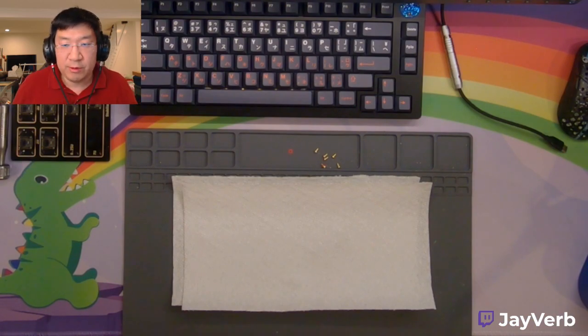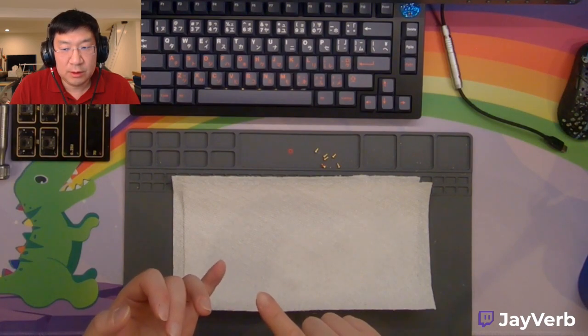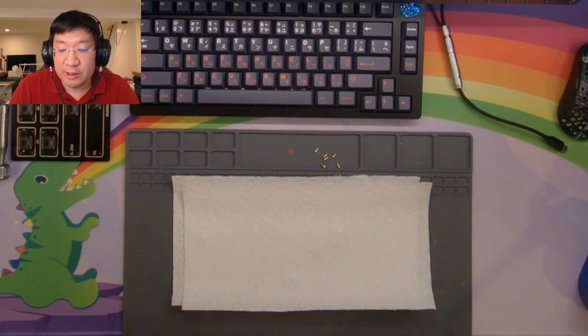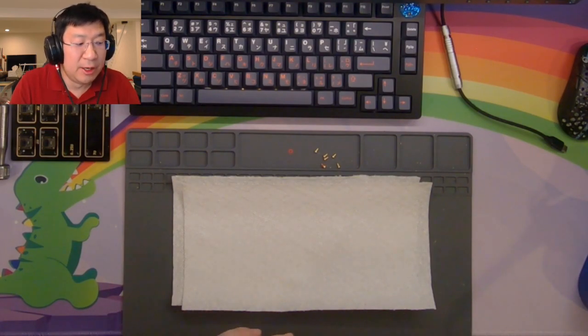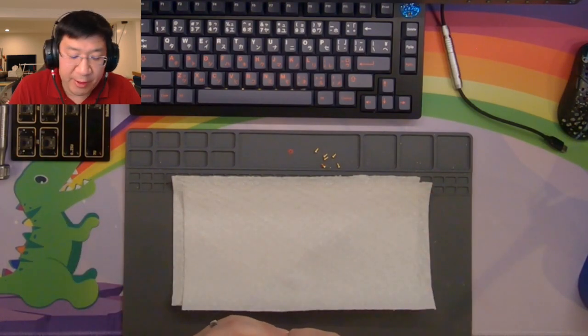Eventually I'm going to do more. Things I have to do. I need to use that FR301 to knock out a whole bunch of Cherry MX Greens from an old board that I have, and then do the science experiment of seeing if I can add Cherry Hyperglide stems in there and see if that works, because they're old housings. I want to see if I can just make that work so I don't have to buy more switches, and if that does work, I'll use that in Odin actually whenever I build that.